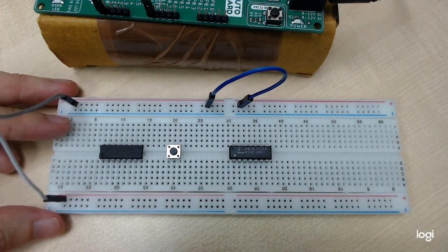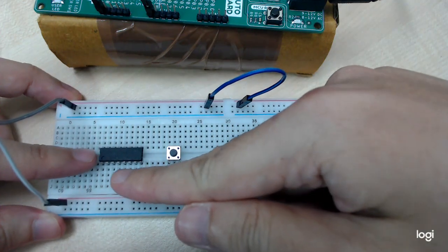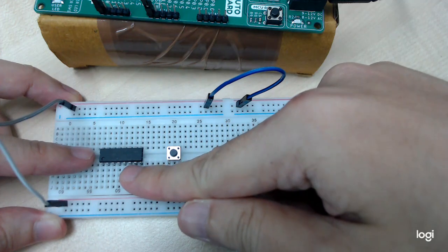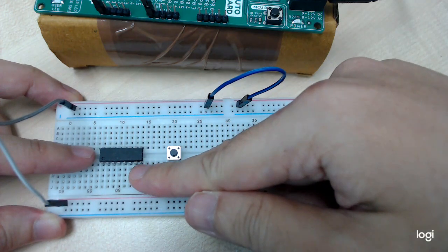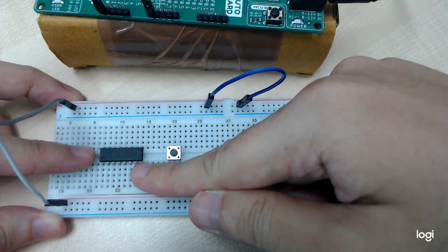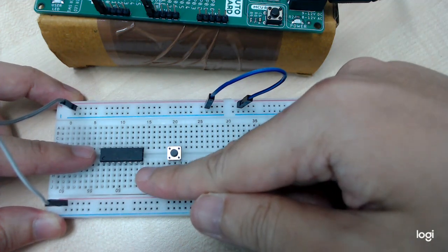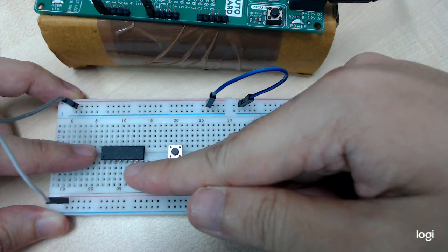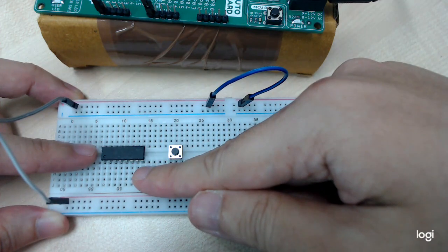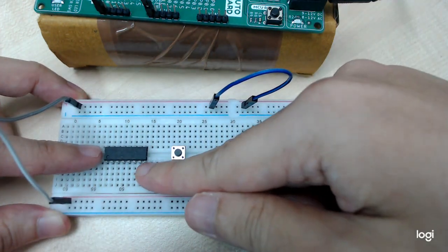The first thing we need to do is get the IC for the D flip-flops. I will start with the D flip-flops. In this IC, this is a 74LS175. So it is for the D flip-flops. In the Tinkercad simulations, we are using the 74HC74, which is the same as the one in the lab box, the 74LS175. So they are used for D flip-flops inside.